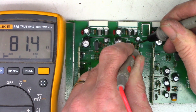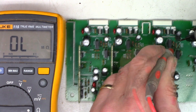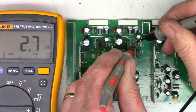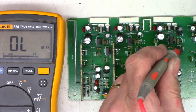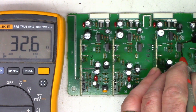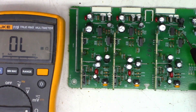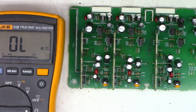I'm seeing about 82 ohms on two of the resistors, but I'm getting 0.7 and 0.5 on another — something's going on with that one. Checking adjacent resistors: 2.7 ohms, 217 ohms; 2.8, 217; 2.8 and 219. So why is this one resistor reading way off at 1.5 when it should be about 81 ohms? Checking another: 32 ohms and 33 ohms. Does it have a shorted driver or is there a problem on the pre-driver board? Let's dig a little deeper.